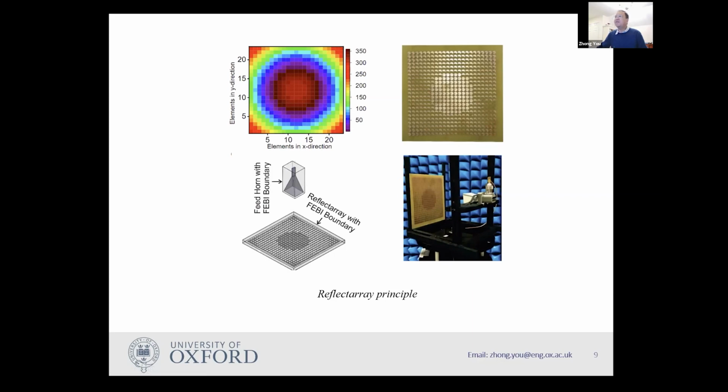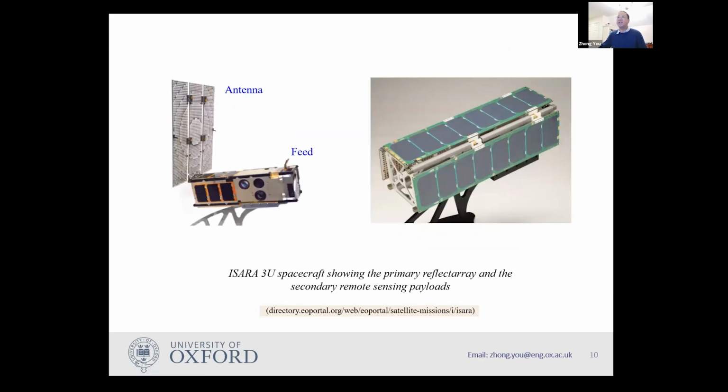So now, instead of folding a parabolic shape, the important thing is that you need to fold a flat array. Therefore, the flat array is used both as solar panels and as antennas, so it becomes more common in aerospace structures. The current folding of this array is pretty simple. For instance, in this case, we have an array made of three panels. You just wrap it around a satellite. In this case, the folding is pretty straightforward.